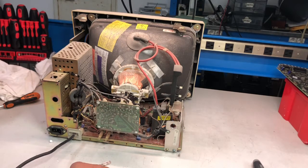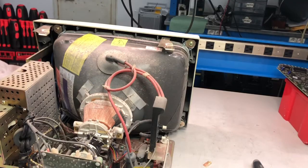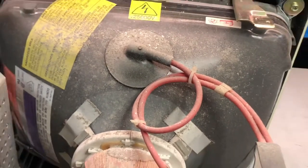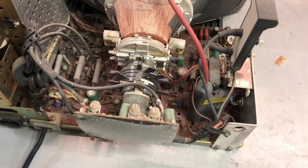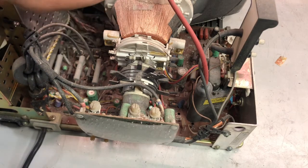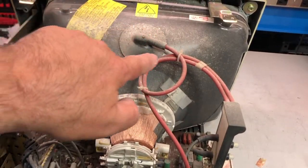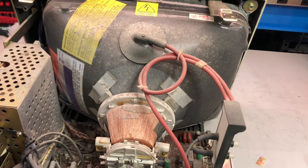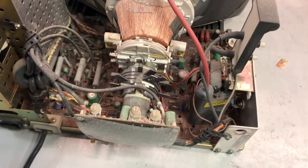I found a label inside. Okay. So, well, this nastiness here clearly will make it not happy. By the way, the CRT neck is intact, which is very important. And I have to say that there is a very limited amount of powder and black residues around the high voltage, which makes me suspect that this monitor has had low hours of usage. So that is promising.